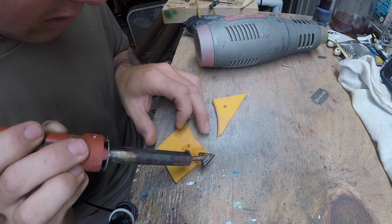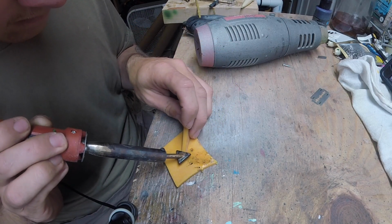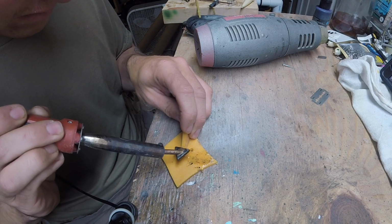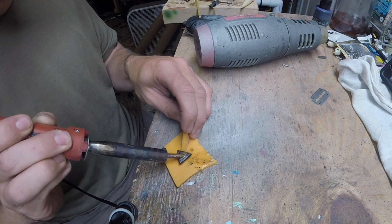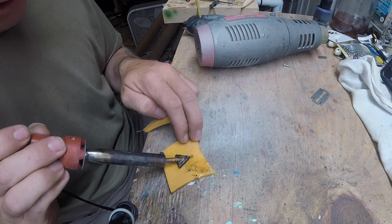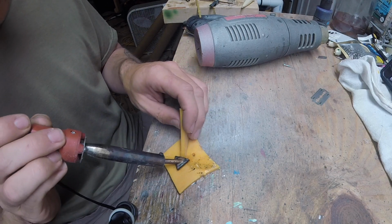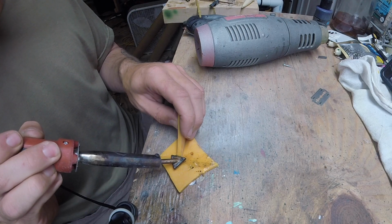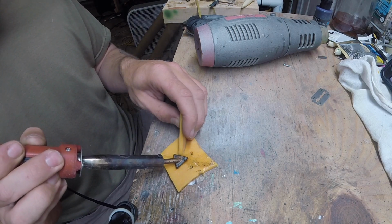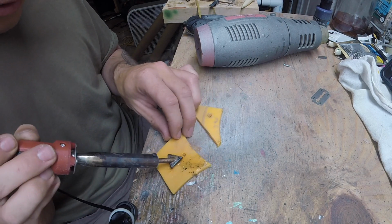Now, the more time you take, you can make this smooth, look pretty good. Put more plastic down. Now, I will caution you guys, do this in a well-ventilated area, right? You are melting plastic, or if you're going to do it inside a garage, say it's really cold outside and you don't want to be out there, I highly recommend wearing a respirator. For this, you guys got to be able to hear me, so I've got my garage door open and it's letting in plenty of air for me, so we'll be good.